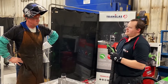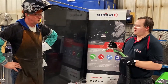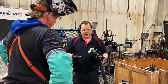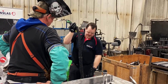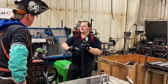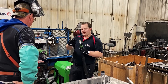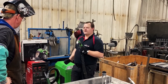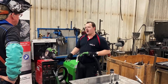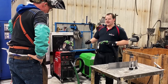The gun I have here today is a 16 feet, 5 meter. We have four lengths: 3 meter, 4 meter, 5 meter, and 6 meter — or 10, 13, 16, and 20 feet. The hose on the gun is not round — from the neck back, it grows; it's a conical hose. The hose carries that fume through the gun and we want to maintain a certain static pressure and CFM as we're sucking out the fume. The hose is also crush resistant, spark-resistant, and heat-resistant up to 600 degrees Fahrenheit. It's ribbed on the outside and smooth on the inside.